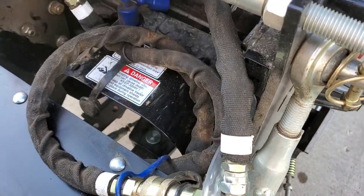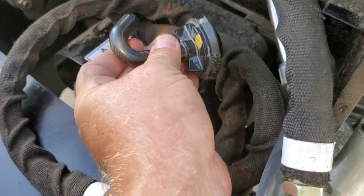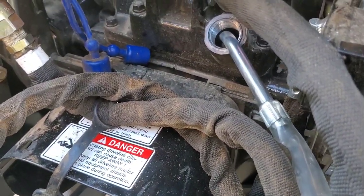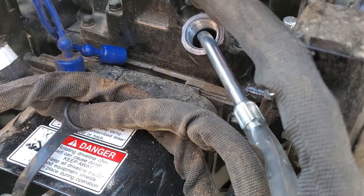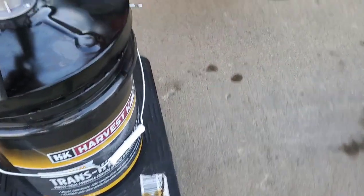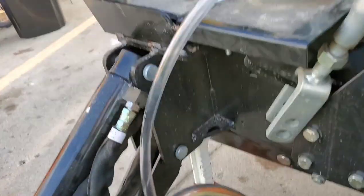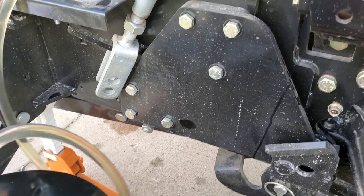Now on the back of the tractor you'll see a little rubber cap with a breather hole on it — and that's for where your hydraulic oil is added. Now this thing takes four and a half gallons of hydraulic oil. So it is nice — it's not required, but it makes it awful simple — to have a little hose hooked to a pump that can hook right to your bucket of trans hydraulic fluid. So then when you just sit here and get it pumping, as you can see it just starts going right on through. Makes life a lot easier with trying to put that much fluid into something.